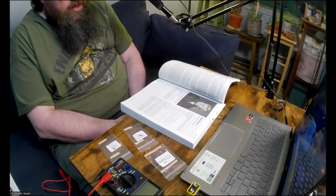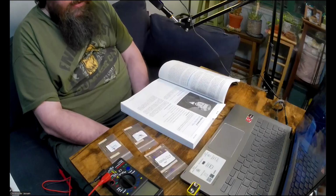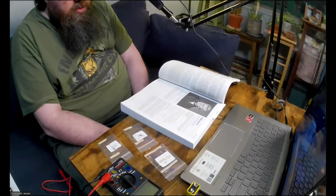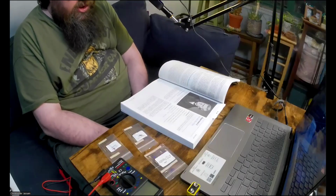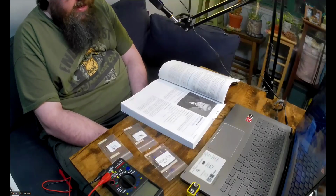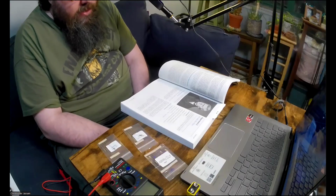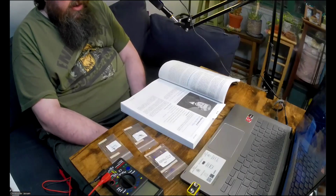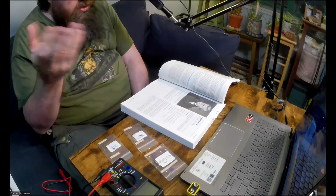So often we need to add electrical resistance to a circuit for reasons that you'll soon see. This can be done very easily by using components known as, guess what, resistors, which have their values measured in ohms. Resistors that you acquire for the projects in this book may or may not be labeled, but that's okay. You can find out what their values are. First, I'll show you how to measure the values, and then I'll explain how to decode them. Some resistors have a number clearly stated on them in tiny print that you can read with a magnifying glass, as shown in figure 2.1 on the next page. Unfortunately, most manufacturers don't print numbers on their resistors. They use a color code.